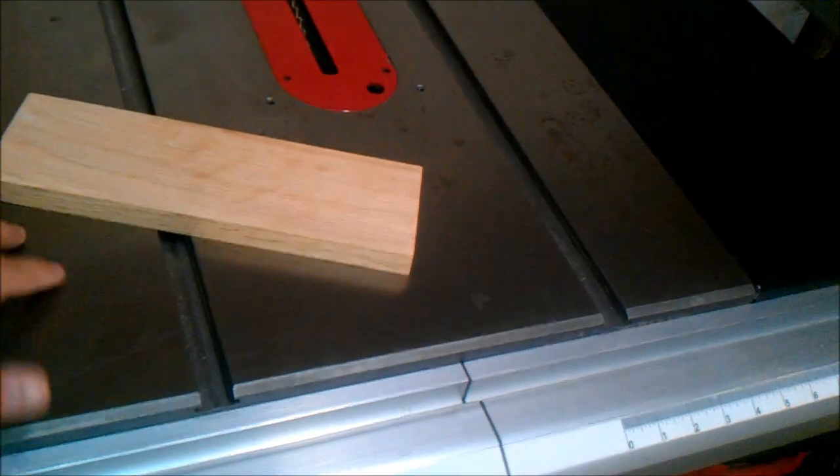If you can see this board, I can just push it in and it just glides right across — I'm not putting any pressure on it at all. That's really what you want when making cuts; you want it to glide across, you don't want anything sticking, especially with plywood. Whenever I haven't cleaned it for a while I get more tear-out and it gets a little wobbly. Definitely worth your time to do it. Check out my website at woodlogger.com and I'll continue to put more videos and tips and tricks out there.